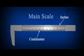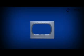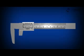It consists of a long rectangular metal strip which has a fixed jaw on one end. It is graduated in inches at its upper end and centimeters at its lower end, which is called the main scale. There is a movable rectangular metal strip graduated with a special relation to that of the main scale, called the Vernier scale, which slides over this long metal strip.